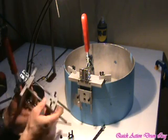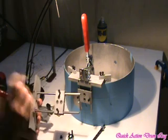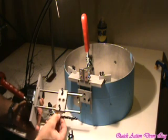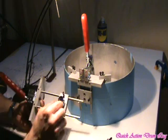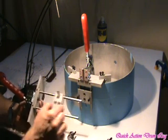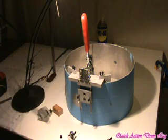For other lugs, what we're going to do is take this plate and put one drill bushing per plate, have two plates, and also have a bar that you can use to set those two plate distances. The easiest way to set two plates would be to put a lug in, set them, and then slide both plates together up and down as required for your different drums and lug positions.